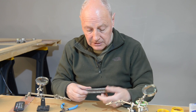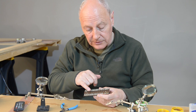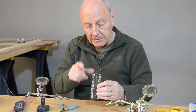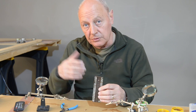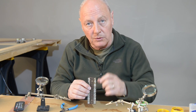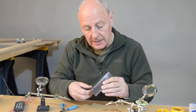But there we go. So the only other thing to do then for you is to put another wire on the other side. And then, like I say, if you mount it on your layout with a piece of paper underneath it, you can actually mark up that terminal 1 goes to 0.3, terminal 4 goes to 0.4, to the station lights or whatever, and you can mark up exactly what you're doing before you screw this to the underside.